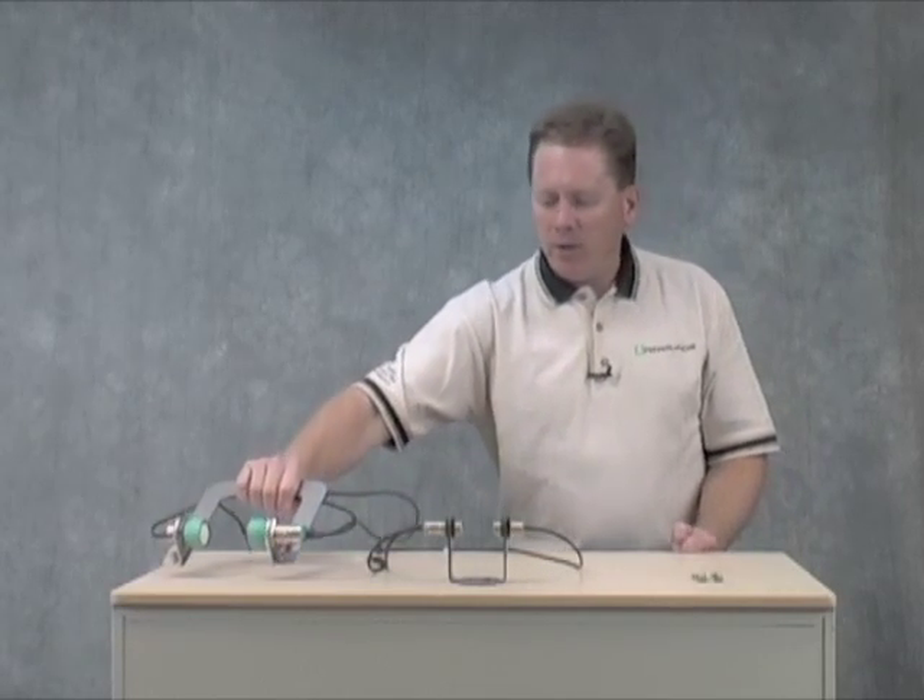This version is our 30mm UDC, and this is for the heaviest applications. It's got the biggest transducer and thus the loudest sound pulse, so we use this for corrugated cardboards and heavier sheet metals. Regardless of the application you need — from very thin papers to heavier sheet metals — Pepperl & Fuchs has a solution for you.